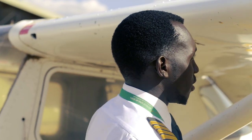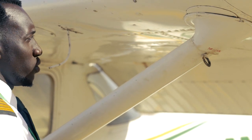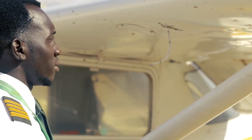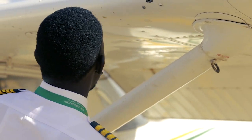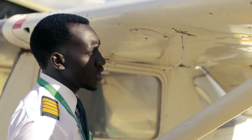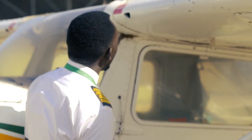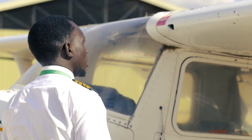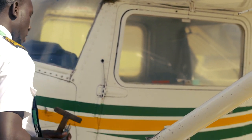We check the fuel breather. This one is mainly to drain excess fuel and to balance the pressure in the tanks — it's not obstructed or blocked, it's good. We check the pitot head — it's not obstructed, it's all good. Inspection panel looking good. The wing strut looks good. Tap in the intake — it's okay. Check our door is secure.